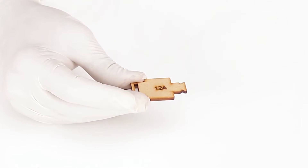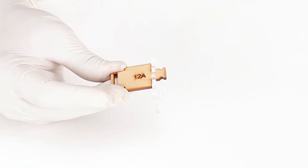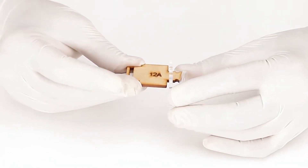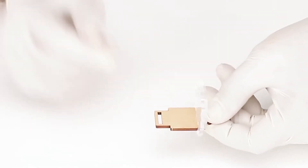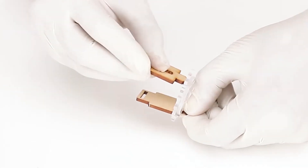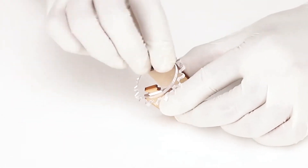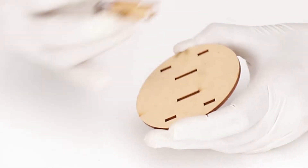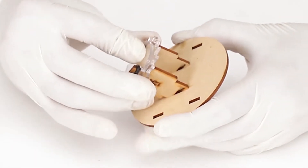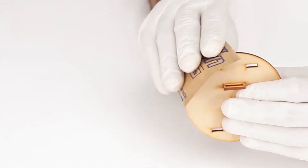Let's construct our acrylic gear set. Insert part 12A into one of the slots in the acrylic gear from above, then further insert part 12A in the circular acrylic disc — make sure the circular part is below the acrylic gear. After that, insert part number 12B into the slots of the acrylic gear and circular acrylic disc. Secure both parts by a black washer. Kindly apply wax on the gear. Now insert part number 13, the circular plate, on the top slot of 12A and 12B.